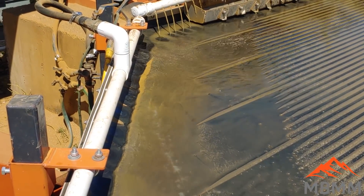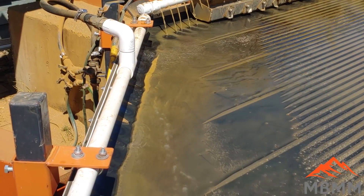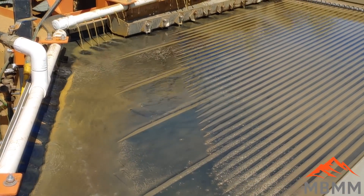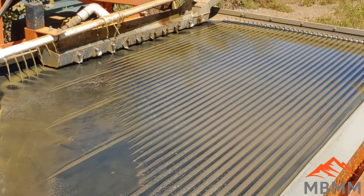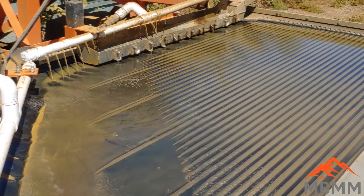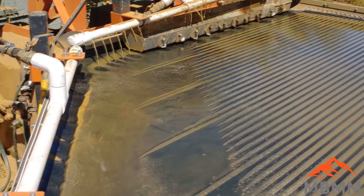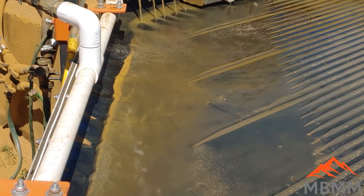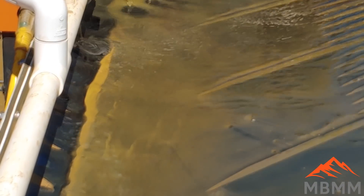So there's a good part of the gold out of the one and a half or two tons that we ran. This gets brushed down out of the grooves of the table when we're all finished, because it takes a while to build up in the grooves for it to be enough volume to sweep the gold out. So you always have to brush out what's left over after you're done running the ore.